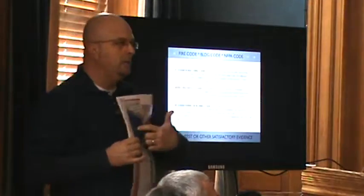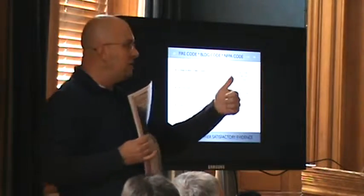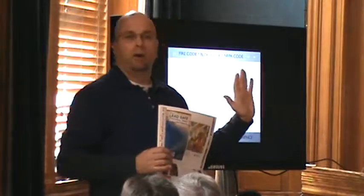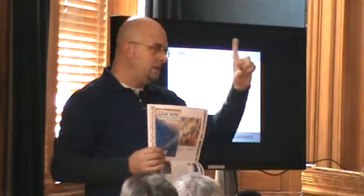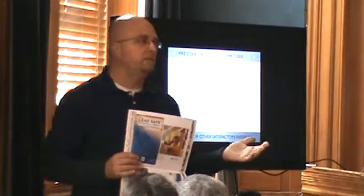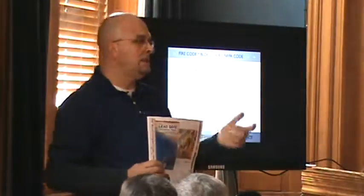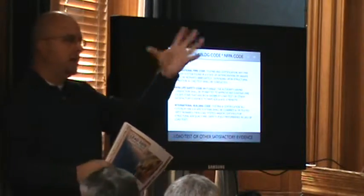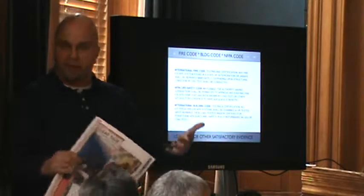We're also going to talk about lead. EPA 2010 says you can't burn anything that has lead older than 1978 — you need your renovator's license. Any contractor can go for eight hours on a weekend and get that class. As long as he attends in the morning, by the end of the day he gets the piece of paper, and then registers their firm with the EPA for $300. They have a license that says they know how to wear the little white suits, plastic gloves, and mask and collect all these chips from the building or from the fire escape.